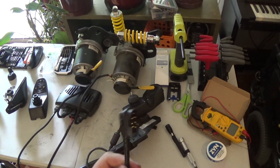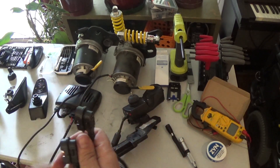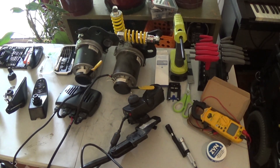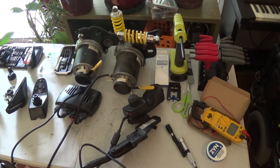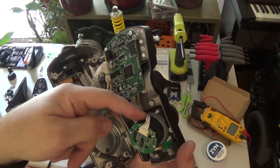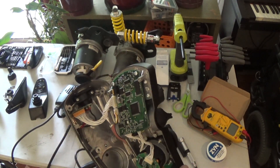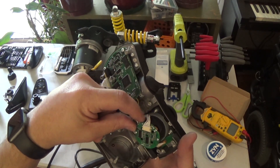This one uses the flat connector, so I've got a little adapter harness set up here so it can be plugged into the controller. We're going to plug the adapter into the pigtail. I've taken the screws out of this. This one is ideal for interfacing the joystick gimbal because it's got physical wires connecting it to the main control board. I'm programming an Arduino to basically inject voltage into these wires.